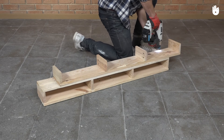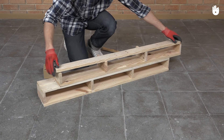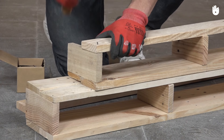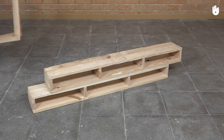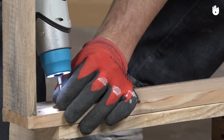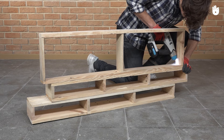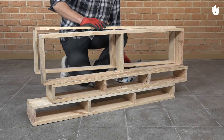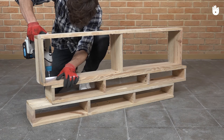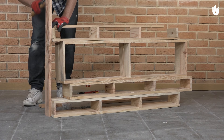In order to create a more original space, shift up the pallet to create an asymmetrical look, then close the unit. Add to this a pre-assembled large module. To maintain an equal depth, screw two large frames next to each other. Continue like that, varying the height and width to give the bookshelf an asymmetric look.